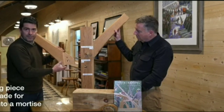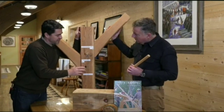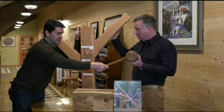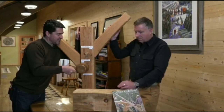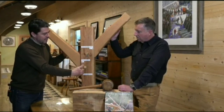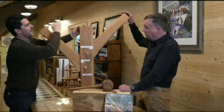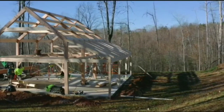In our mock-up the hole is already drilled, but historically that hole would not be there yet. In fitting those two pieces together you would test the fit, make sure it's snug and secure, then drill that hole through both pieces. What we've got as a fastener is an oak dowel — sometimes referred to as a tree nail or a trunnel — and once that hole is drilled through, we drive that pin in and lock those two pieces together. That one-inch peg goes through the wall of the mortise, through the tenon, and out the other side, creating an interlocked assembly that forms a rigid, strong structure. You can imagine horizontal timbers, vertical timbers, and braces on the angle creating a really strong, rigid structural framework for a building that's going to last a long, long time.